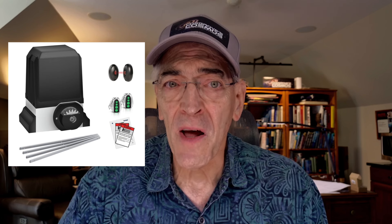Originally, I was thinking about using a gate motor system available on Amazon. This system seemed powerful enough and configured in a way compatible with opening the roof. It even had add-on options like Wi-Fi control modules. But as I dug into this further, I realized none of this was going to integrate with astronomical applications very easily without quite a bit of work. What I was really looking for was a control system with ASCOM drivers so I could connect with various astronomical software, and something that would easily integrate with a weather system or all-sky camera so I could close the roof under automation.